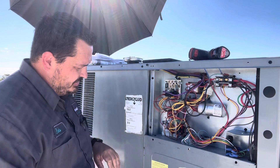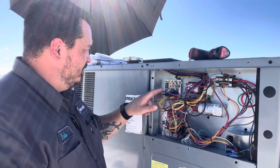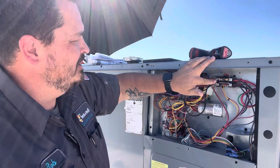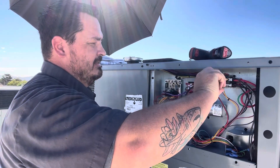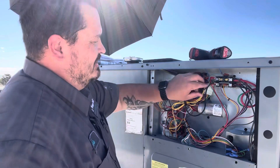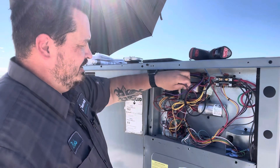Visually I don't see anything wrong with the control board - no burn marks. Going to check the capacitor. There's no burn marks on the contactor, no pit marks. Looks good. Everything's nice and tight. Make sure all these connections are good and tight, nothing loose.